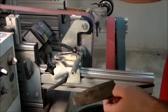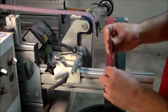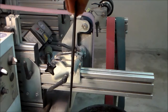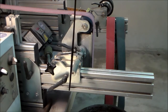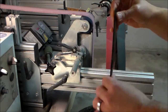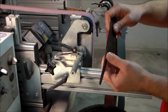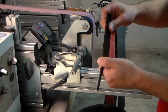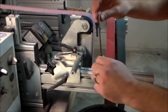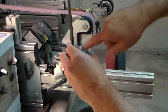Normally, you'd think I would use the flat plate for that, but I don't, because I don't know if you can see this. But the place where the tang hits the blade, that's always the thickest part of knives I make. I want a thick connection to the tang so that it's strong, and I want the blade to be thinner. So as this part is thin, this part has a bulge where it meets the tang.